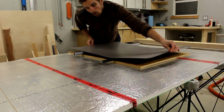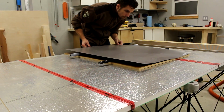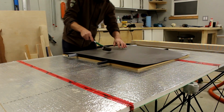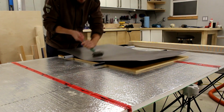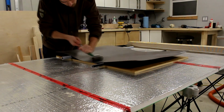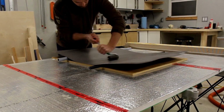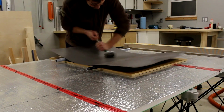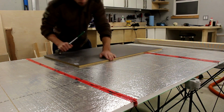After about half an hour, the contact cement should be dry to the touch, and you can use 2 dowels and center your piece over top. Then using a laminate roller, start from the center and push the dowels kind of out towards the edge as you go. Be sure to press down firmly and try to get any air bubbles out after.